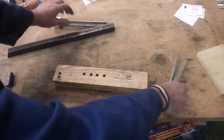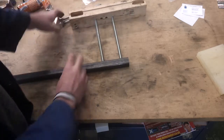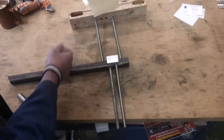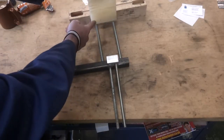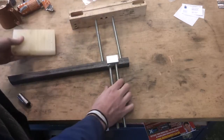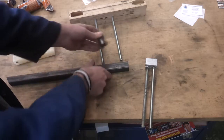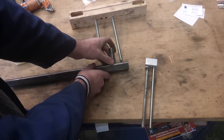On the other side - which is what the other two holes are for - it's simple to align over this end, and then that will be here. This is going to go onto a collar which will attach around the main shaft of the center punch with a couple of holes here and here, and this will stop the thing twisting. So next stage is to drill four holes in here, then locate and weld that in just the right place.